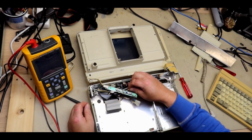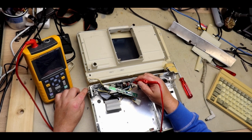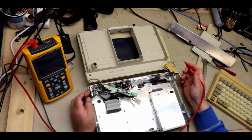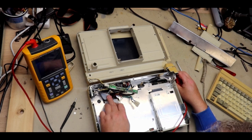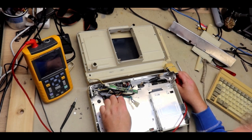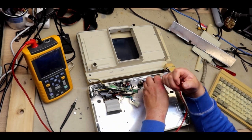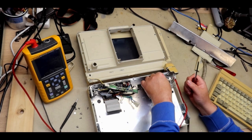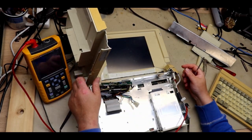It's actually stated on the board that the yellow wire is the plus adapter, and the plus adapter is the center pin as I can see on the back. That means I need to find the barrel jack, plug it in here, and inject my voltage. This connector has 5 volt, 12 volt, and the ground wire, so this is probably it. I'm going to disconnect this so I don't break anything more. I do wonder about battery leakage or damage. To check if anything is working, I think we'll do just fine with things as they are.